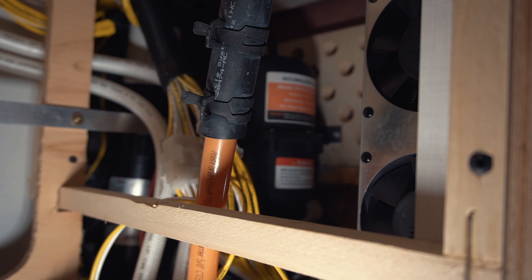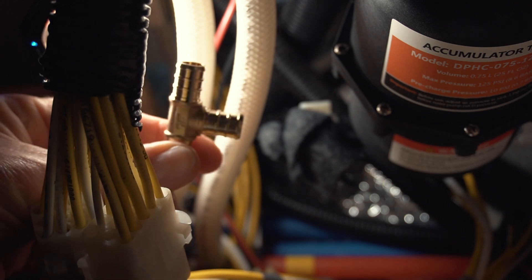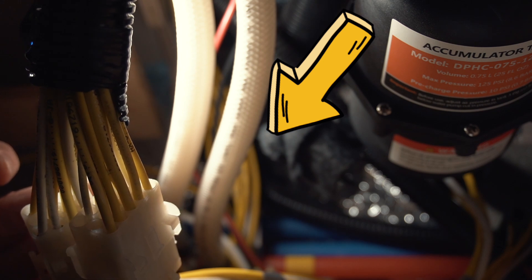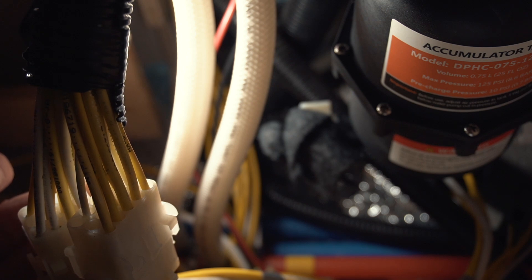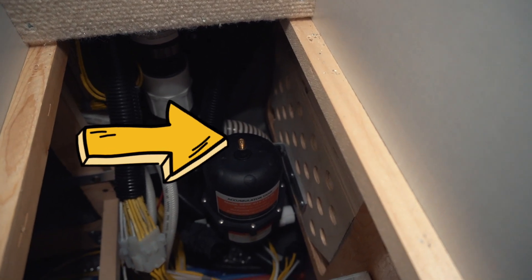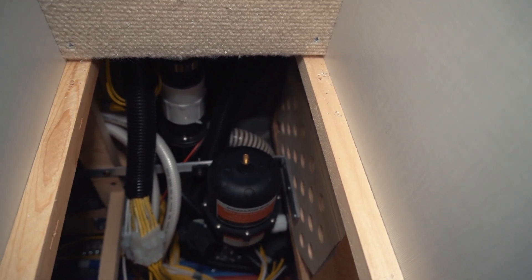It's not connected yet — I still need to tie it into the water line. The cold water line is here and I need to cut in a tee, then connect the bottom of the tee to the inlet of the water tank. It's currently wrapped in some felt to protect the port. I pressure tested the tank earlier so it's a little wet on the inside. The accumulator tank requires a little maintenance; every once in a while I need to access the Schrader valve at the top and adjust the internal pressure. With the bottom shelf of the pantry removed, there's plenty of access to the tank.